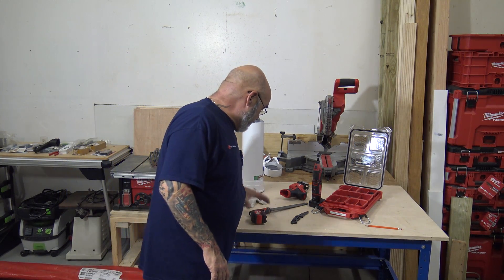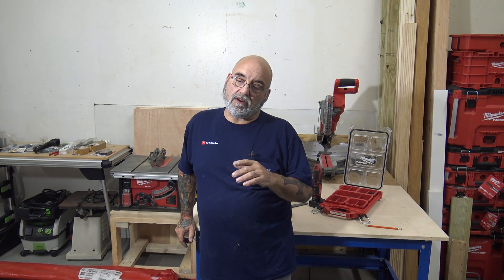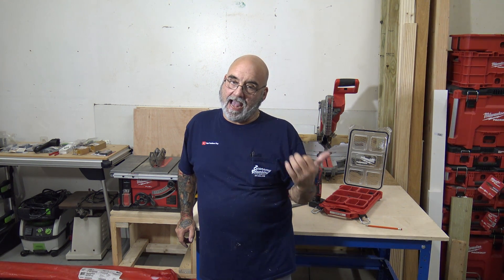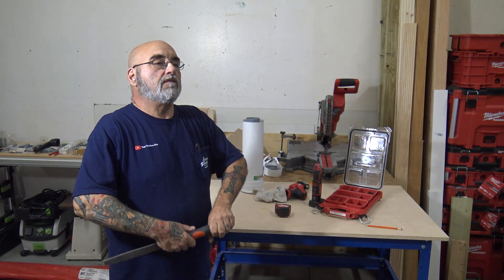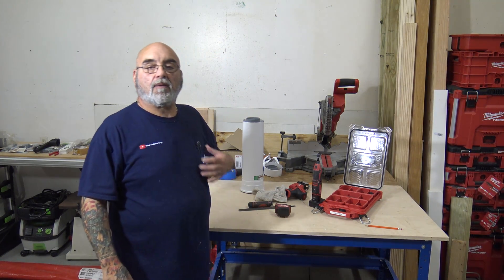That is what you need to do to cut a piece of concentric piping. Remember - you're not cutting straight through, and you want the inner pipe to be a half inch longer than the outer. This is a big question I get, especially from guys who just cut straight through and have a problem. If you cut the inner the same length as the outer, the fan will actually suck the carbon monoxide going out the middle pipe back in to the burner, using CO for combustion - and the unit makes a lot of noise. It took about 20 minutes for poly; metal should take about 30 minutes once you're accustomed to it.